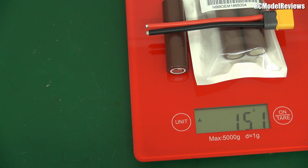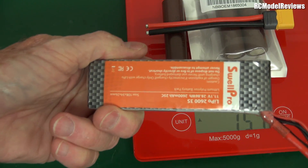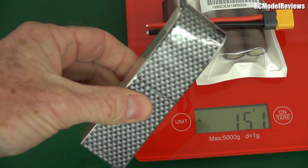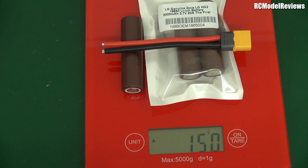That's a huge difference — 151 versus 218 grams — and the lithium ion pack actually has more capacity at 3000 milliamps versus 2600. So you get a much better power-to-weight ratio. One important thing to consider: LiPos are 3.7V nominal and charge up to 4.2V, but these lithium ion cells have a much lower minimum operating voltage. A LiPo pack is pretty much flat at around 10.5 to 11 volts, whereas lithium ion cells can go down to 2.5V per cell.